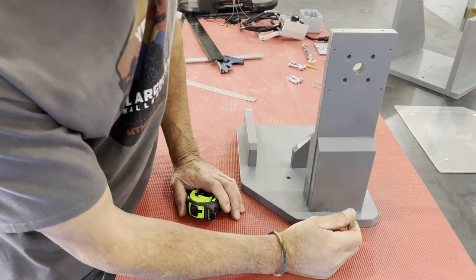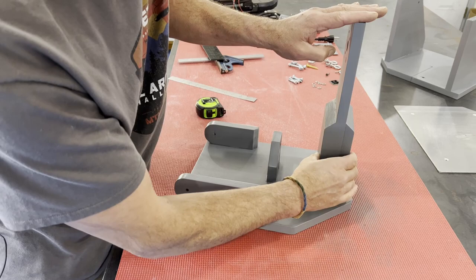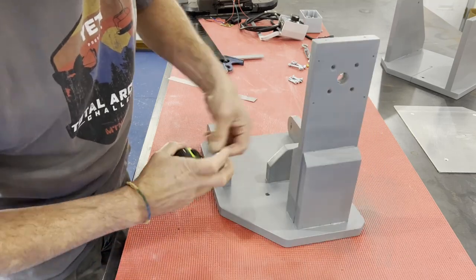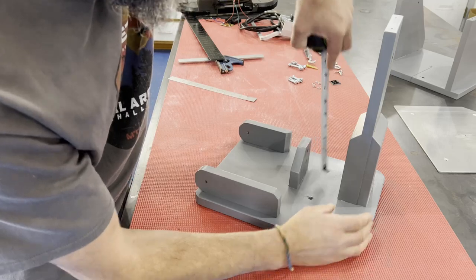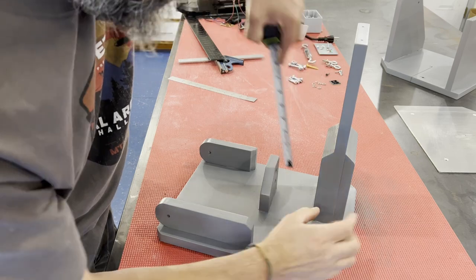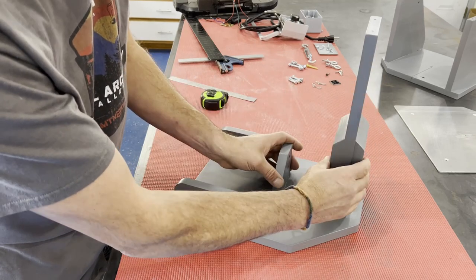Due to the length of this piece, I glued a piece of two and three-quarter inch material on both sides as a stiffener. Here's the smaller tab that mounts to the bottom of the motor — I arbitrarily picked three inches by three inches and it worked. I laid the whole hole pattern out: inch and three-eighths up, and then one inch center to center, and those were right in line. I then bolted these two tabs to the porta-band.